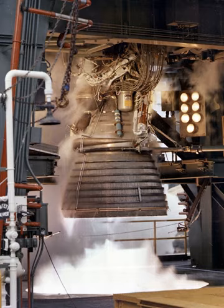During the initial phase of engine operation, the gaseous hydrogen start tank would be recharged in those engines having a restart requirement. The hydrogen tank was repressurized by tapping off a controlled mixture of LH2 from the thrust chamber fuel inlet manifold and warmer hydrogen from the thrust chamber fuel injection manifold just before entering the injector.